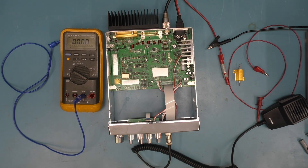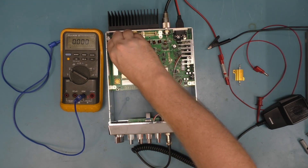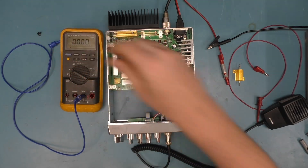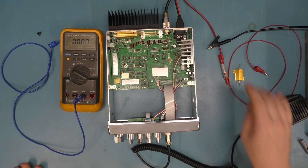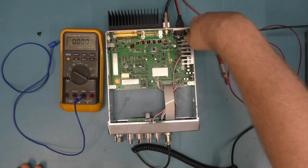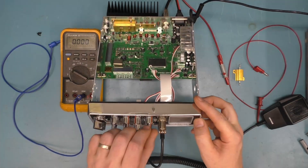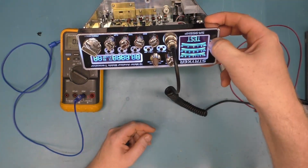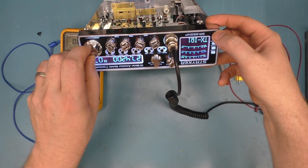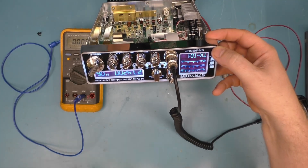The first thing we're going to do is remove the three shunts — all of them get removed. Second, take the negative from the 10 volt supply and attach it to the chassis. Then put the radio into service mode and navigate to TX IQ 1 to start, as you do them in order: 1, 2, and 3.